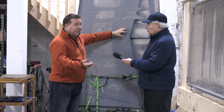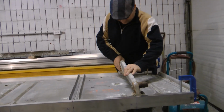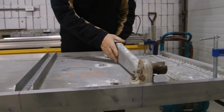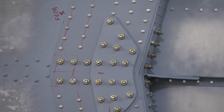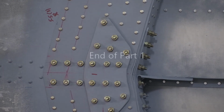And I may have described it before, but when parts become corroded, the aluminum flakes like a French pastry, and it balloons. It changes volume probably 10 or 12 times its original volume. So what it does is it just pops all the heads off the rivets as it rots. Yeah. It expands and just pops all the heads of the rivets off.